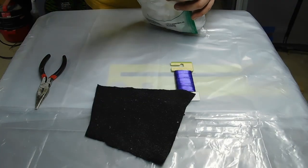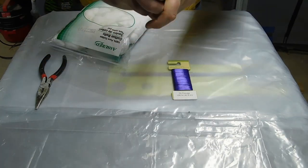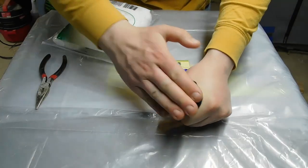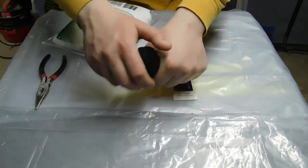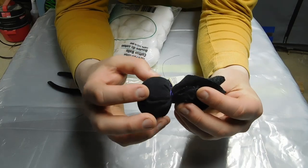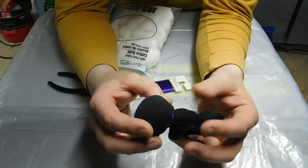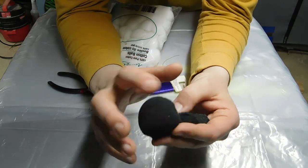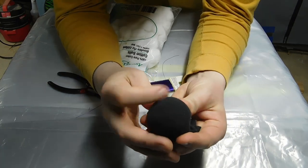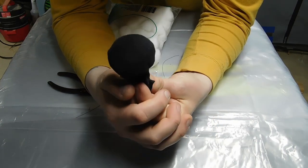We're going to put down the fabric, stuff a bunch of cotton balls in it, and bring in the corners. You want to get it relatively tight but still be able to squeeze it, because you want those cotton balls to absorb the shellac and solvent. Now we have an applicator that has a reservoir of cotton balls and a nice smooth finishing pad. If you're concerned about lint you can take a fabric shaver and shave off the top layer, or just find something like linen that's less likely to shed fibers.